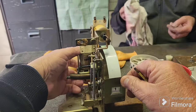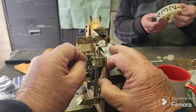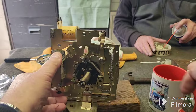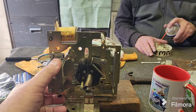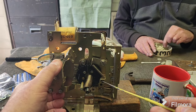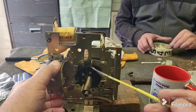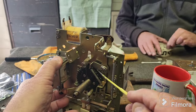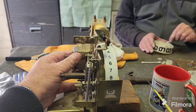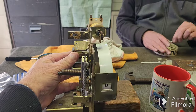We'll add some replays. Oh, hang on. Put it down first, then we'll add some replays. It's got to check the escapement wheel. You see, when you drive up on these, same as the Gottlieb, your drive pawl pulls down, engages, and then as this goes back, that drops in to check the tooth. Now let's ring up a few replays. Let's simulate that being stuck like that. So we're on 10 replays. You watch what happens now. It goes straight back to 0.